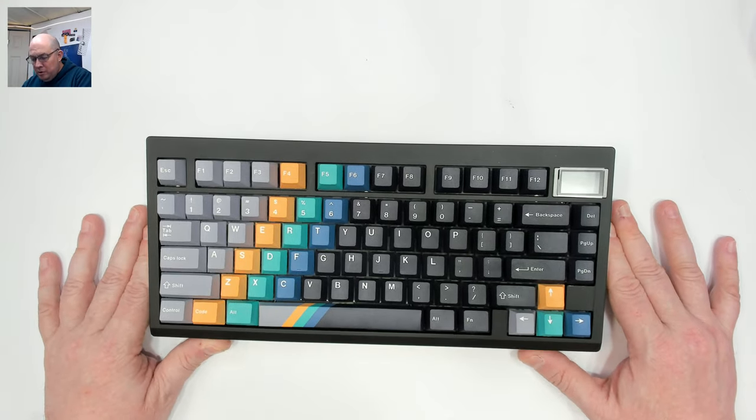But one of the things that I do recommend with these is to go ahead and please use something plastic. There is a battery right about there, so you don't want to be using something metal, but something plastic that'll go through. It doesn't have to have too much of a point, but go ahead and make those holes, because the center post of switches does not have a sharp tip. It's just a dulled bottom. Instead of actually puncturing through the PET plastic, and it's a pretty thin layer, I'm going to say about 1 or 2 mils, but I don't have a way to measure it, really, it pulls on it, so it drags it and bunches it up, and it can make for a crunchy sound.